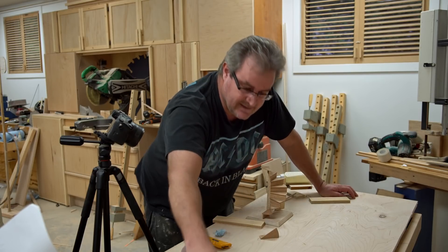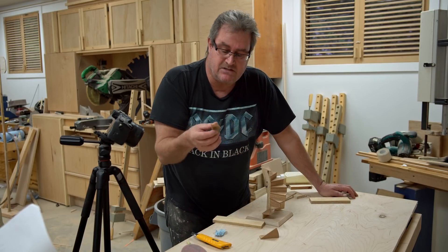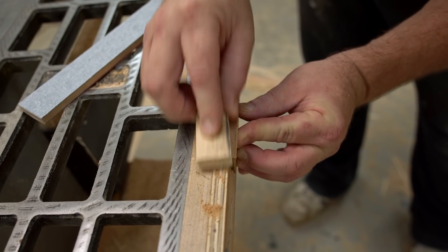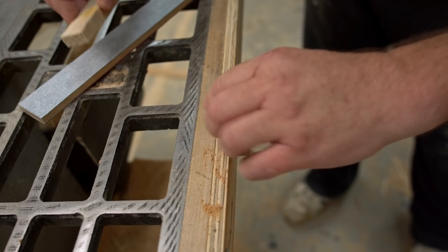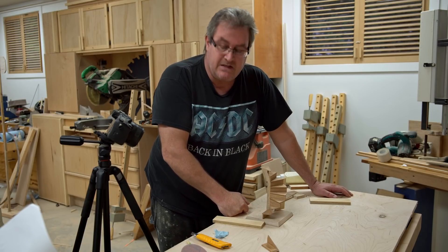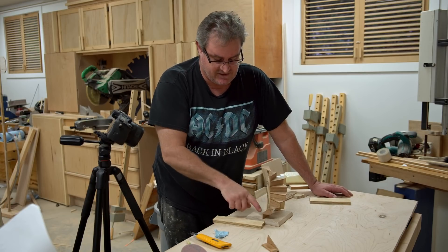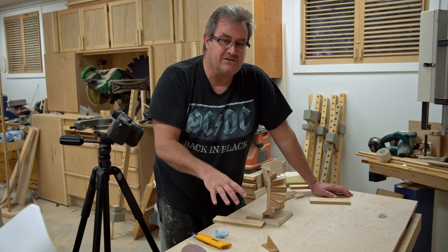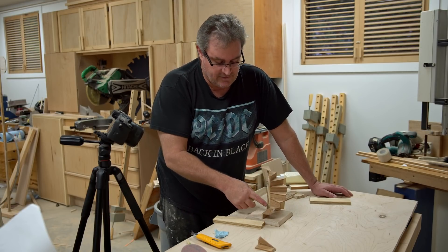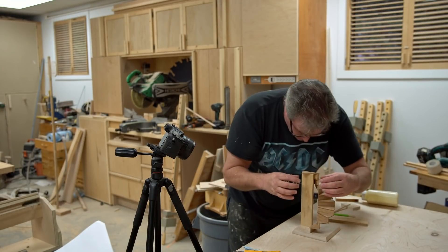In the meantime I sanded the last two steps. I've been sanding them as I go because that is a tedious job — I'd say at least 90% of the work here is just sanding so it comes out smooth, since I cut it all with the table saw. This thing is really delicate, and basically the only thing that's going to keep it from collapsing under its own weight is how it's structured. It starts on just one little strip — the bottom of one riser — and that's holding up the whole thing, with everything cantilevering off of that.